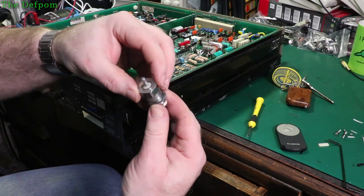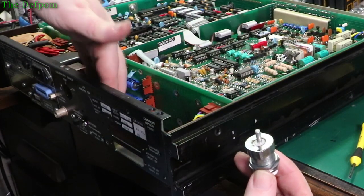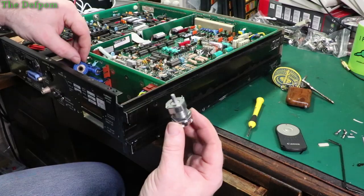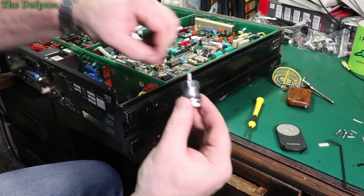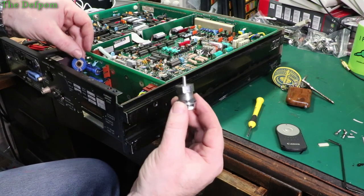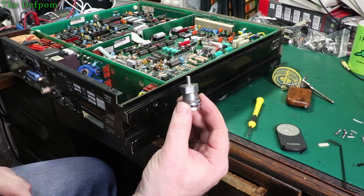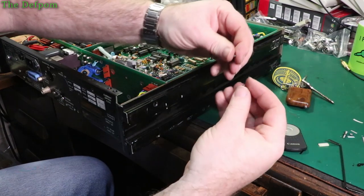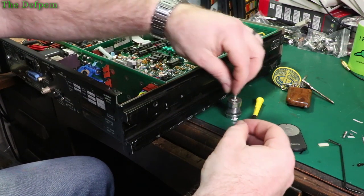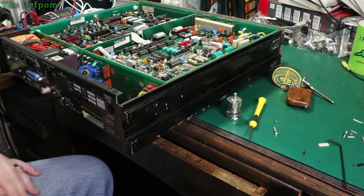I've put all that mechanism back together - all the spring parts. On the back here is just the actual switch itself, the switch wafer. This has got a dual flat shaft so you just make sure the shaft is pushed in in one of the correct orientations. I'm going to put the spacers back in there and reassemble it all. It's pretty simple really, not hard at all. The screws go through the back of the switch and actual wafer, then the spacer goes in front of the wafer and onto the body to space it off.